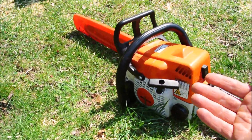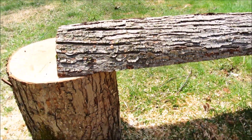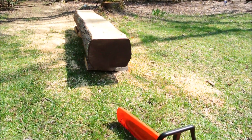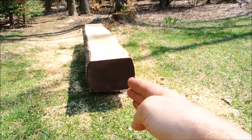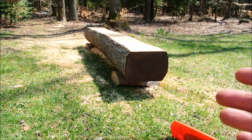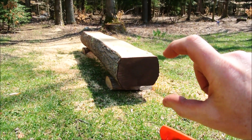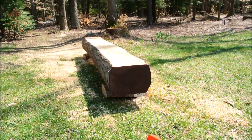I just freehand cut — it's a great way to practice. You end up with these slab offcuts, but practicing your freehand skills is useful and can transfer to other places. Once you get a rough flat spot like this, you can mill the rest of this vertically just by taking slices of it away. The benefit is you're not going through bark on the top or bottom on your finished boards, and the lessened thickness makes it go quickly and easily.